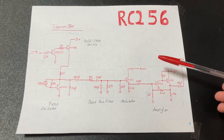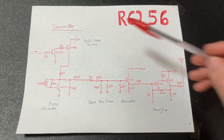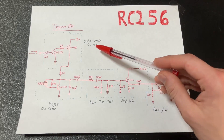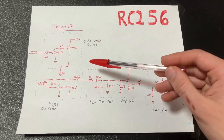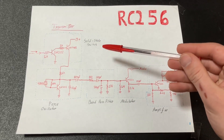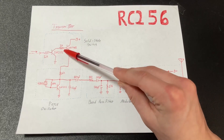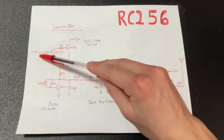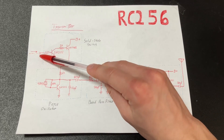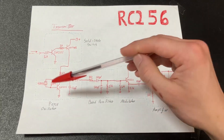This is the transmitter circuit, and it itself is made up of five parts. First, we have what I call a solid state switch. I've been learning how transistors actually work and how to use them to turn things on and off. So here I have a PNP and an NPN transistor chained together, which when you feed a TTL logic signal into here, such as the Morse code signal, it'll turn the whole transmitter on and off.